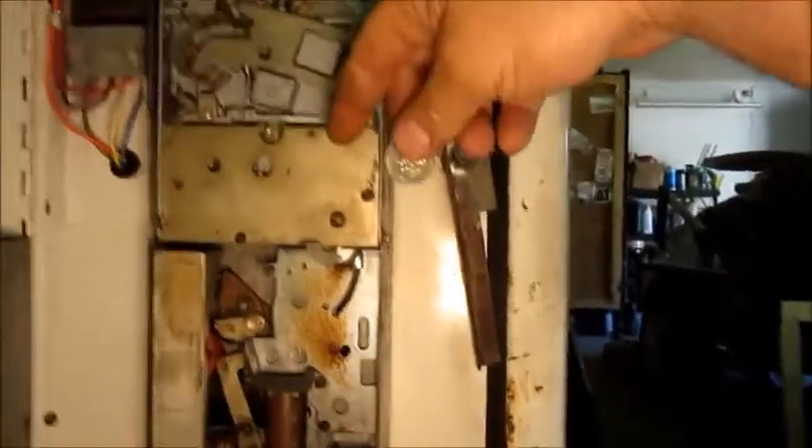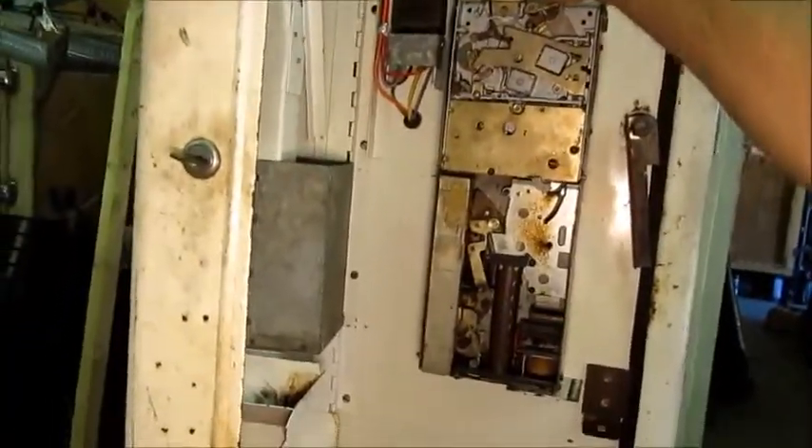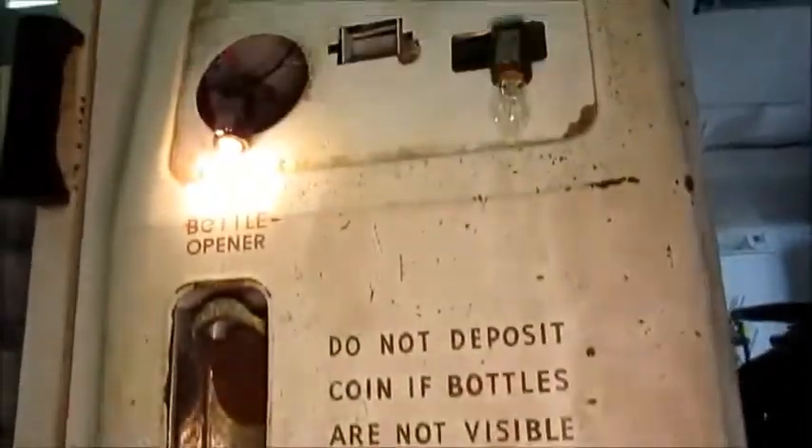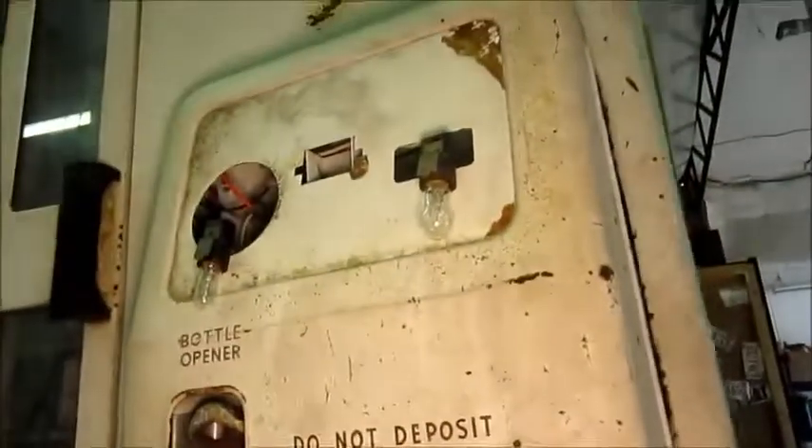The last thing it can do is accept a quarter. If you put a quarter in, it's going to have to give change. The quarter will go through and hit a different micro switch and activate the motor in the cam, and it will shoot out three nickels. So here we go with the quarter going in. I got three nickels out. Again, it's unlocked, so I can go in here and pull it all the way out and cancel that.